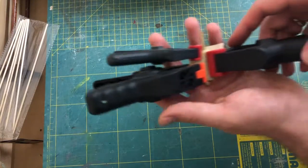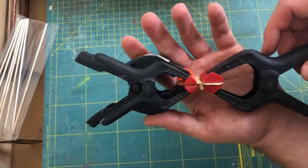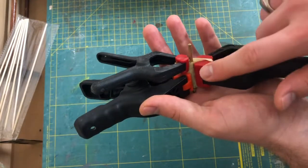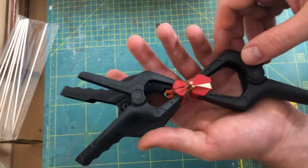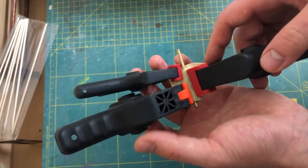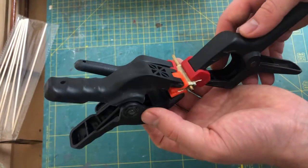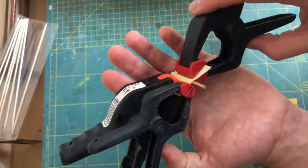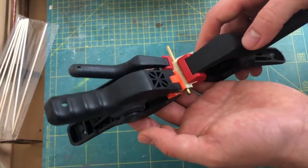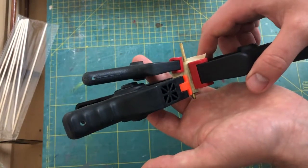I tried to build the rudder. I tried to do that by soldering this brass shaft with two very thin brass metal sheets. Unfortunately, I couldn't produce enough heat to actually get them to stick together. That's why I tried to do that now with 2 parts epoxy glue. So I put that aside and let it dry.